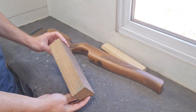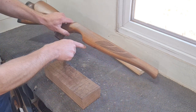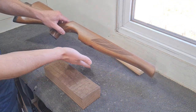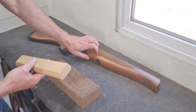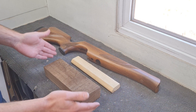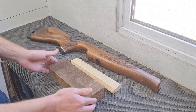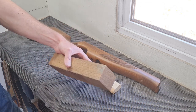For this one I'm going to keep it quite simple. I've got a slab of rough sawn walnut that's just under 10 inches long. I'm going to put a little bit of a swoop so it matches the underside of the stock reasonably well, but keep the hamster flat on its underside - though I may actually put a swoop on the underneath to make it more like a ski. You could use any hardwood really. I wouldn't use poplar - the hamster's going to get fairly well bashed up, so go for something more robust. Maple, walnut, beech is fine - beech is dirt cheap. Even sapele; any hardwood from a timber merchant will do the trick. I certainly wouldn't use pine or any softwoods.